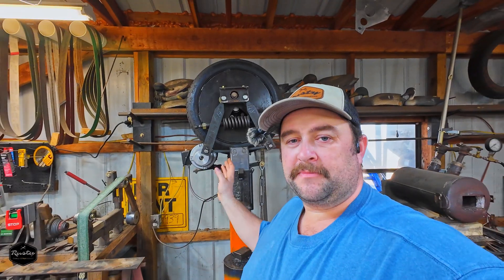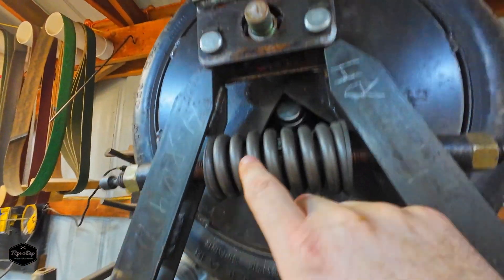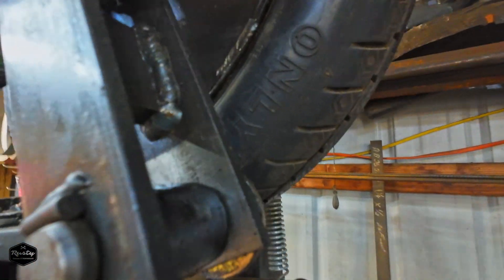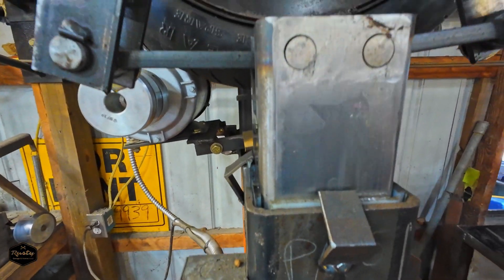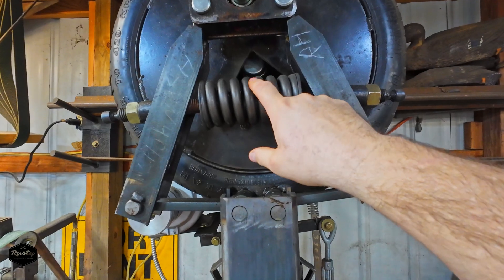Here's the back side — you can see there's a spindle right here, just a spare tire that spins around on this thing. I built this before I was making videos, which would have been a fun little video series. It did take me a while — I didn't work on it every day. I cut all my parts first, then started assembling. All the arms, brackets, and flat plate work I fabricated myself. This does have some Teflon wear strips right inside, held in with little pieces of angle.